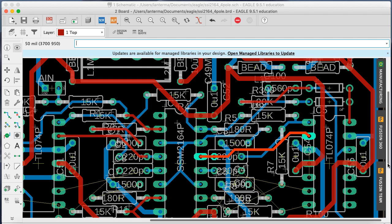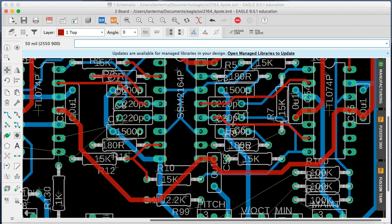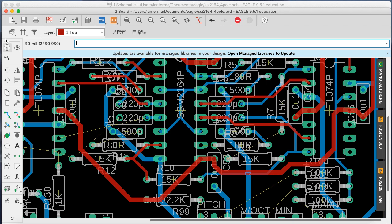Okay, so if that guy's routed, what do we have going down here? Let's switch back to the default of blue. Okay. This guy also wants to, let me move him up a little bit here just to give a little more clearance, just because we can. This one, so there's some crisscrossings here that are going to need to switch to red, like another one. So let's switch to red here, and I'll come up. Actually, okay, that works. And what I'll do is I'll just go part of the way here, run between these pins, come up through here, go there, like that. Let's switch this to red for continuity of concept.